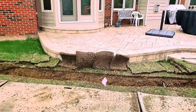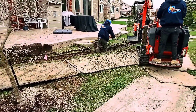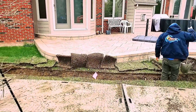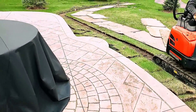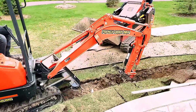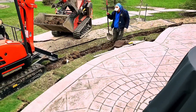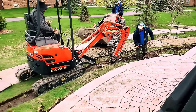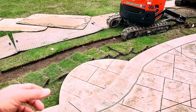When you're shedding water off of a large patio like this, you end up with it being really soft around it. Not only that, but there's base material underneath this patio. After a rain, you have all these expansion joints — all these cut expansion joints — water runs down into the base material. After a rain, for many days this patio is just going to be leaching water. When you go around a patio like this, you do a curtain French drain around the patio, you grab up that water. Now when you step off into your yard, it's not saturated.